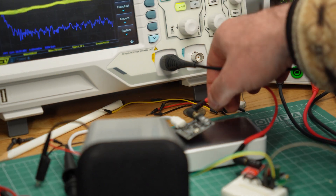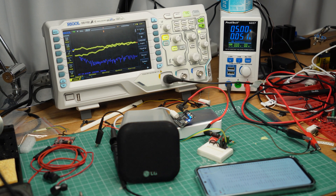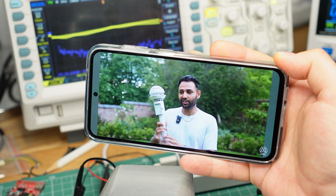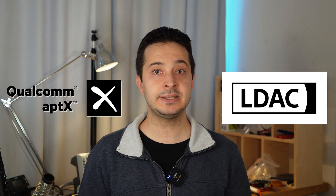The sound quality from these receivers is perfectly acceptable — there is no hissing or beeping when no music is playing, and the volume level gets high. Even at maximum volume there is no clipping and the signal level is consistent across the audible frequency range. There is also no delay when playing video. The sound quality will depend on your streaming service, the type of files you're playing, and the speakers you're connected to. They do not support fancy codecs like Qualcomm aptX or Sony LDAC, but overall they sound fine.